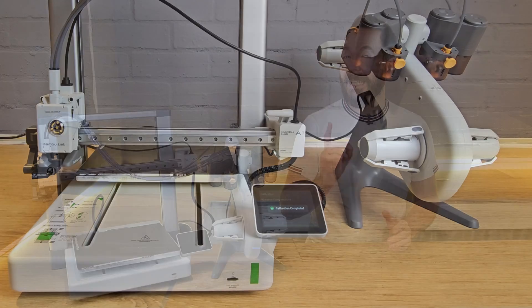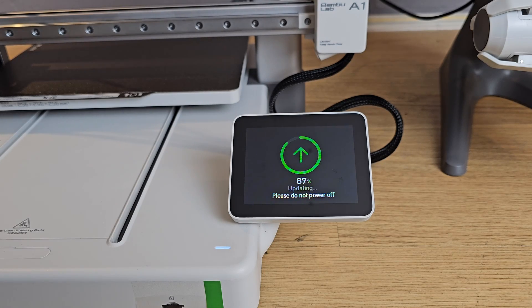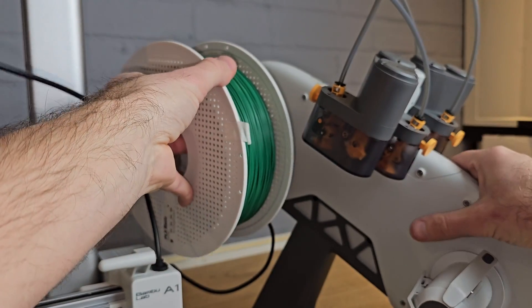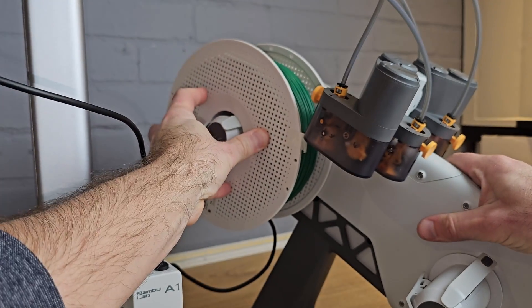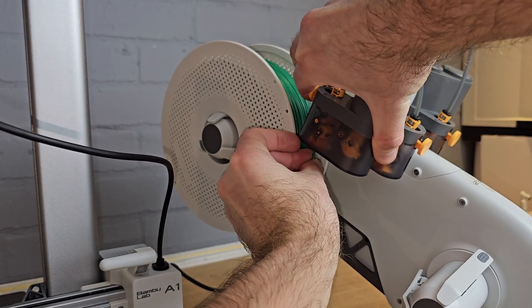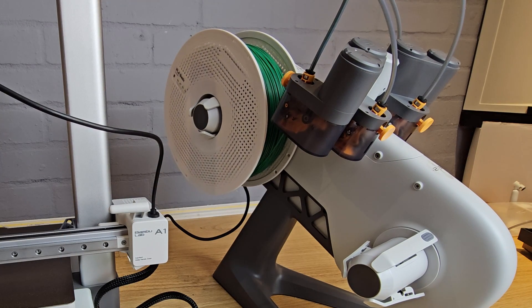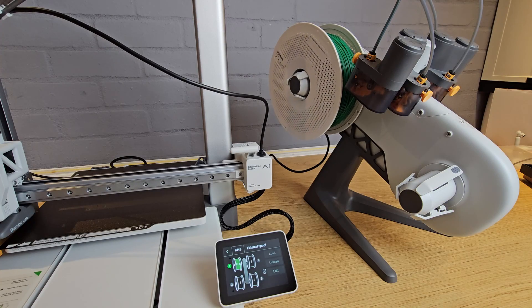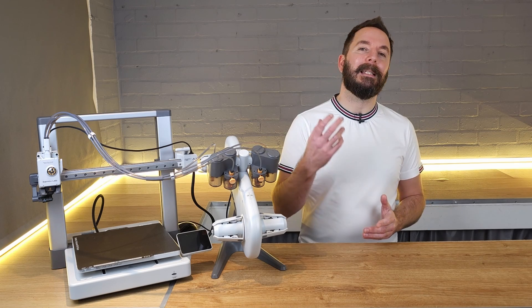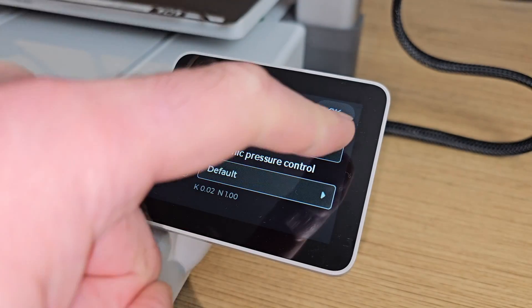When this is all finished you are very nearly ready to print. You may be told that there is a firmware update available at this stage — if there is, let it go ahead, it won't take long. Now it's time to load some filament. If you have the AMS then slot the filament roll onto any one of the spool holders, making sure the direction of the filament will let it feed into its filament tube. Once the filament is pushed in a little way the AMS will take over and feed the filament down the tube ready to be printed with. If you use Bambu Lab filament then the material and colour will be automatically detected. If you use another manufacturer's filament then you'll need to enter these details yourself using the printer's screen to select the filament page and then the reel you want to edit.